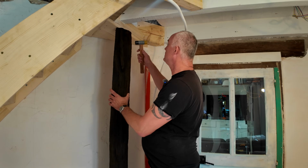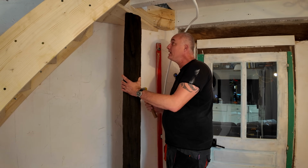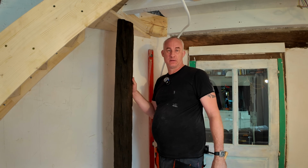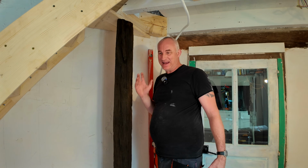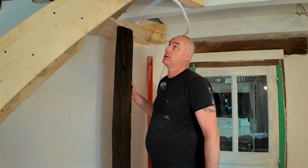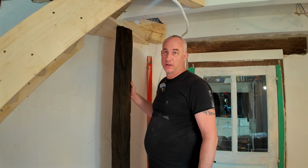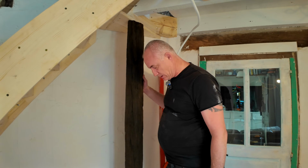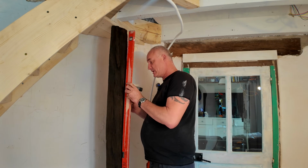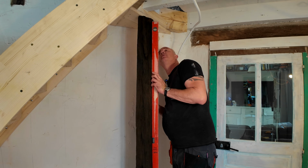Okay, I cut and planed it to size, and I want it to sit really snug because all this wood has been stored outside. It's not acclimatized to interior conditions, and what wood is going to do is it's going to shrink, right? It's not going to expand, because that's what it does when it's humid, when it's wet, and it's likely drier inside than outside. So I just want everything to fit really, really snug. Bloody hell, almost perfect.